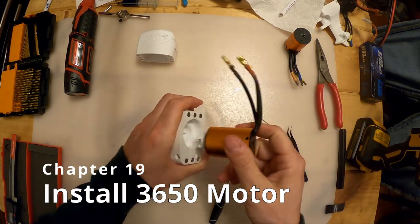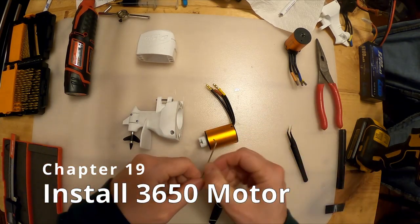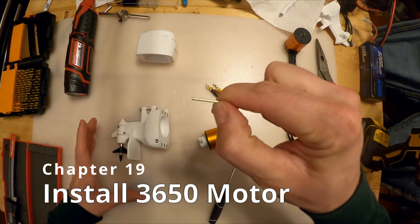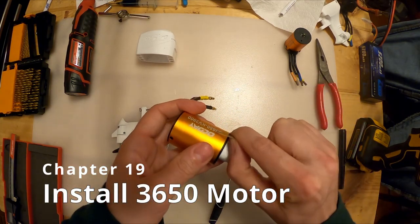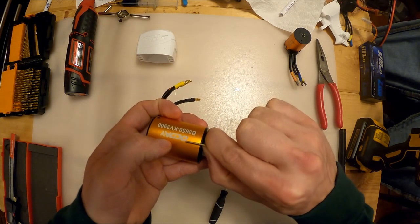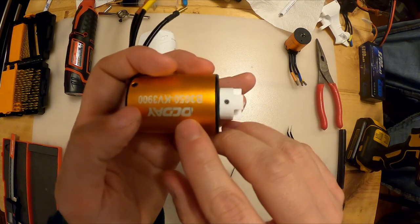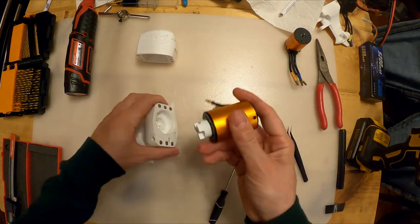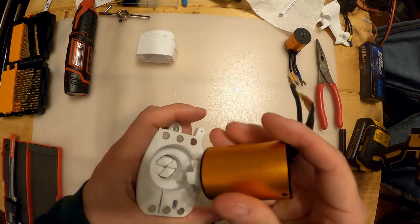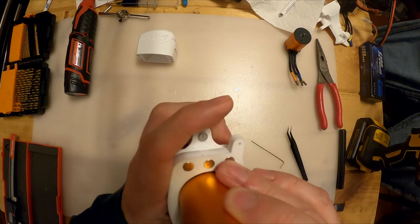So you'll know, quick trick, right? If you take your Allen key, and you know that the shoulder is this deep, so if I put the same marker onto here, I'm using my Allen key to scratch the surface. See how I put a line in that O? I know that that has to be even with the top surface of the outboard for me to know that it went all the way down, and that it's seated all the way.